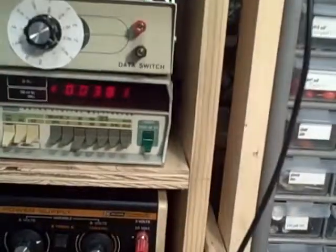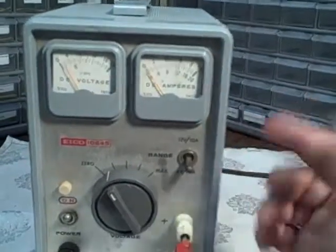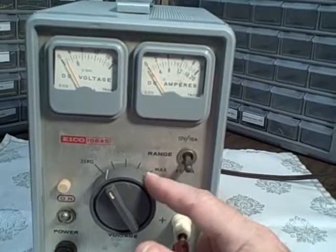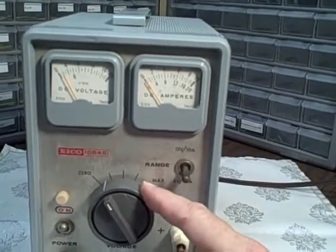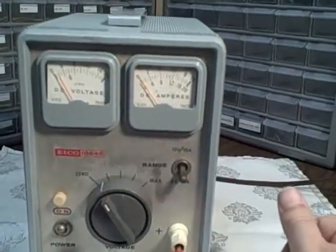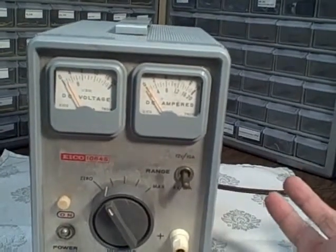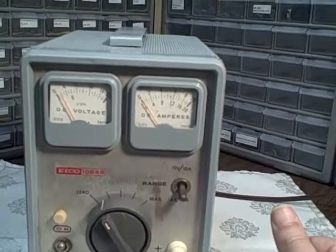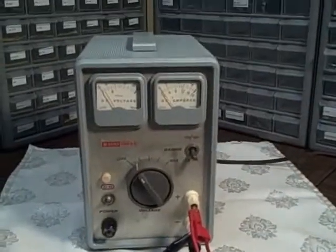The best we're able to do on the 6-volt scale is 8.5 amps and not the 20 that it promised. So there's obviously something limiting the current in the 6-volt range — it could be the switch or possibly one of the contact points on the autotransformer, although I'm not sure. But on 12 volts, you're getting 13.8 amps, which is more than double its spec. So we're doing good. Happy bidding — I'll provide the schematic and the spec sheet with it. Thanks for watching.